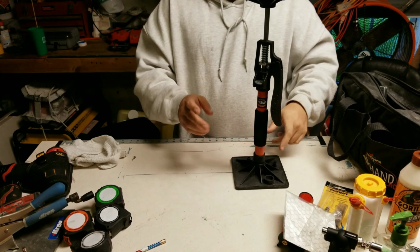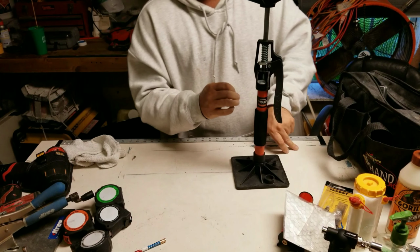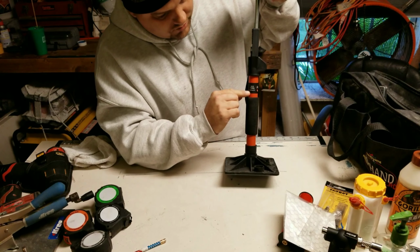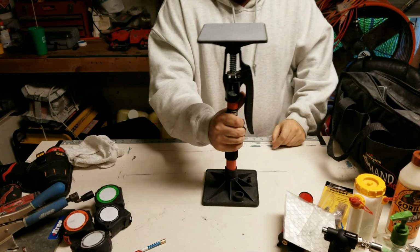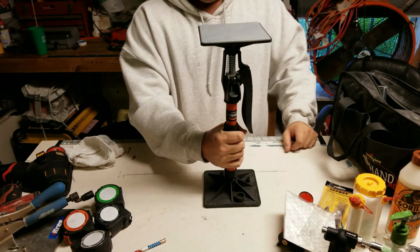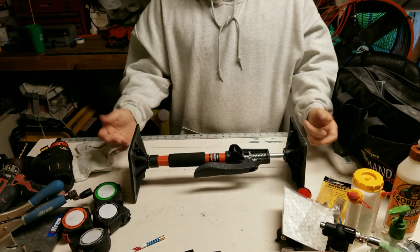Like I said, I have the bigger ones, and I make dust shields out of them. These are called the third hands. These are the little hands. They have several other ones that you can use. They make them in all different sizes. They even make extensions, so you can make them as long as you want. They do 150 pounds each. Now, in my experience, for the dust walls, this is the most heavy duty. The big ones look just like this, but they start at 5 foot. For video purposes, I didn't want to get those out. Maybe one day when I do another dust wall, I'll get my big ones out and do a dust wall demonstration. You can also use them as a spreader, just like you can clamps.